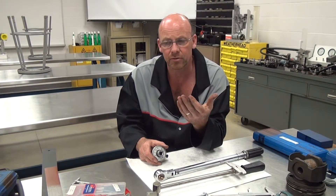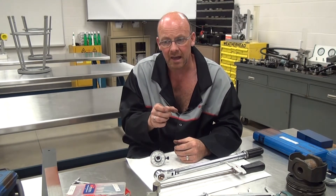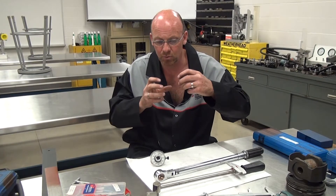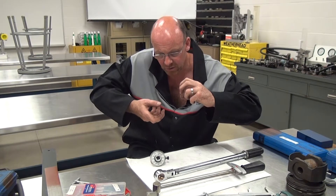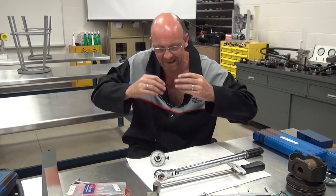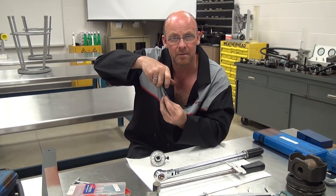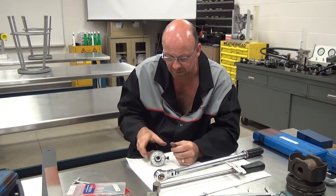Caterpillar asks for you to torque it to 300, then turn it 120 degrees, which is two flats, and a lot of the time that is right in the service manual to be done with an impact gun. What they want is to bring it up to a torque, then put on an additional torque-turn or torque-to-yield. The yield is within about 5% of the fastener from fracturing, so it puts clamping force on that inclined plane — the male and female portions of the fasteners — to maintain that clamping force.